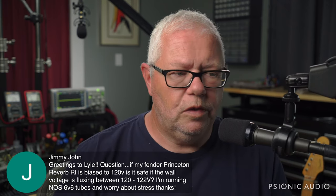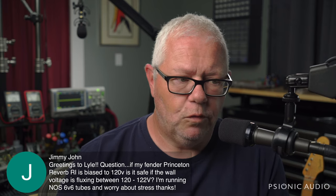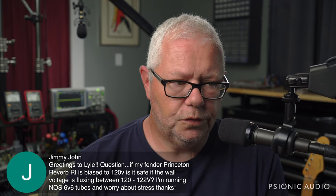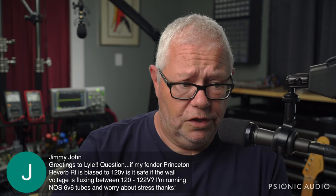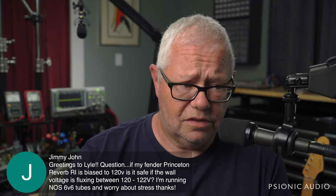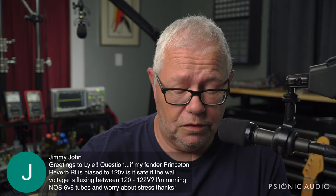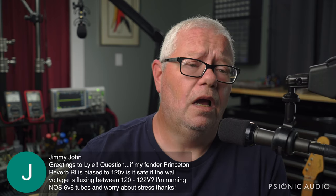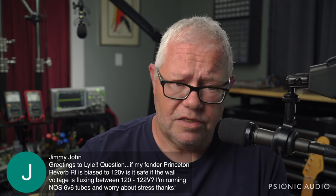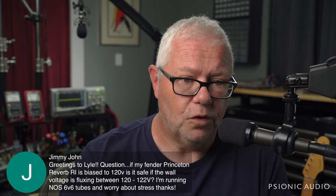If my Fender Princeton Reverb reissue is biased to 120 volts, is it safe if the wall voltage is fluctuating between 120 and 122? Yeah, you're fine. Hopefully, if you have a Princeton reissue with new old stock 6V6s, you've got those tubes biased with the wall voltage at about 120 volts, somewhere in the 45 to 55% range of idle dissipation, in which case that little fluctuation from 120 to 122 is nothing. Yeah, don't worry about it.